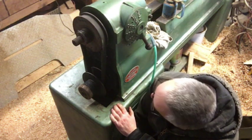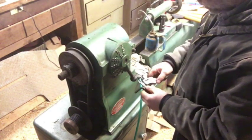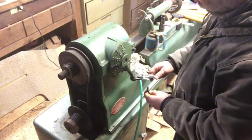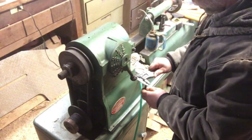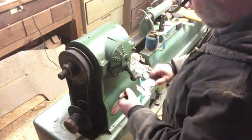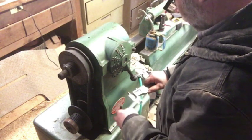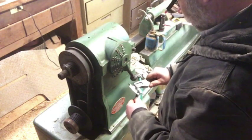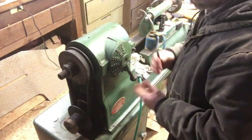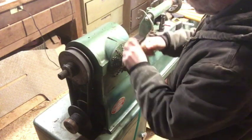The variable speed handle comes off with a hex nut. The hex drive size is 7.94 millimeters — since this is American made, that works out to a 5/16 hex head. I went ahead with this 5/16 Allen screw.